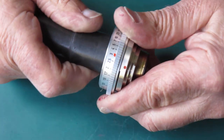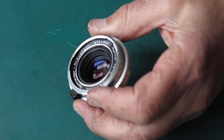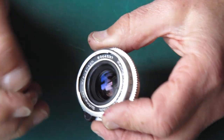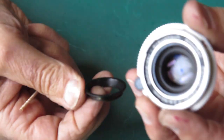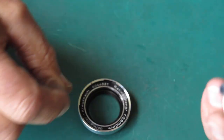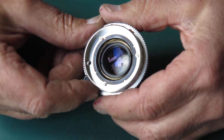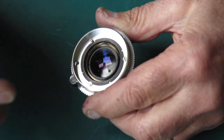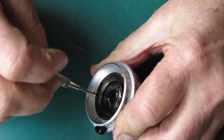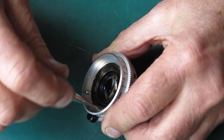Using a friction tool on the front to loosen the conical piece in the middle that holds the front name ring in place. There are three screws and washers that hold the lens capsule and helical into the mount.